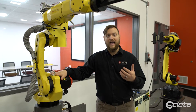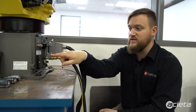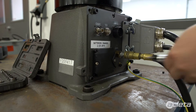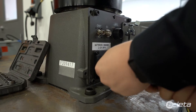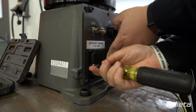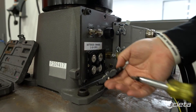After your robot has run, we recommend changing the batteries. The batteries are located in the base of your robot. One important thing: make sure that the power to the robot stays on when changing these batteries. To remove the batteries from the robot base, go ahead and remove this cover, which is spring-loaded. When putting the cover back on, note that these screws are a little delicate, so apply adequate pressure but do not over-tighten them.